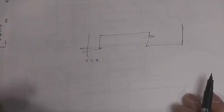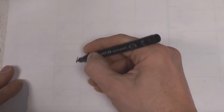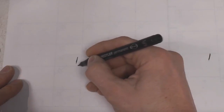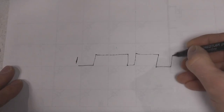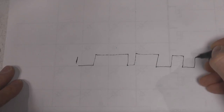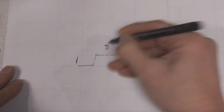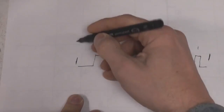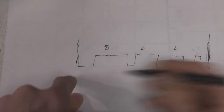So there's actually a better way of doing it, which is what these panels do. Just to simplify this, I'll pretend that we're only going to do 16 levels, which is 4 bits of grayscaling. Instead of doing that single pulse, we create 4 time periods, each one double the next. So our lengths are 1, 2, 4, 8 within a regular cycle. Within each row we'll do this.